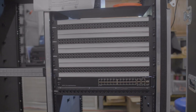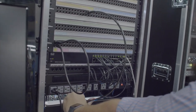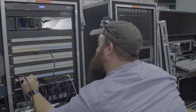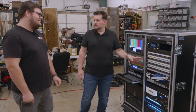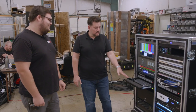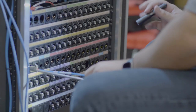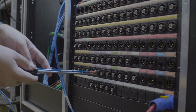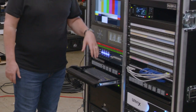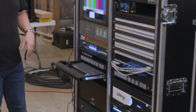As great as everything you put in here, sometimes things just happen. You get a power surge, sometimes equipment fails. And anything in production, at least in my history, the show has to go on. So the patch bay has always been cheap insurance — if one of these components fails, a few patch cords and we can get around it and still make the show happen. And so it's something that we do in all of our systems. Even though it takes up a little space here, you won't ever use it until you need it. And you'll have it — absolutely worth it.